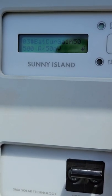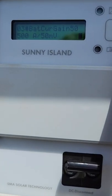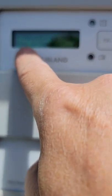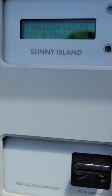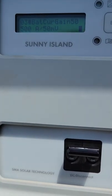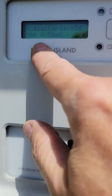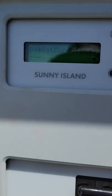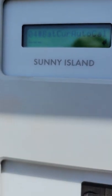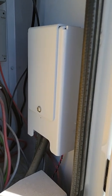Hitting the down arrow now shows the battery current gain setting. Other videos just say use the default, but the SMA rep had me change that to 500. I'll have to do more research on what that 500 actually means — it could relate to battery capacity, in which case it might be 540 or higher since I have two batteries in parallel, but this only allows up to 1000. For right now, go to 500, enter, confirm yes. Now we want to calibrate, which is the next menu item, but we need to do some physical work first.